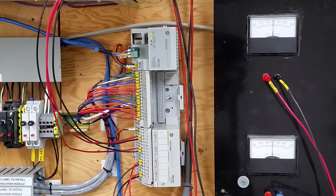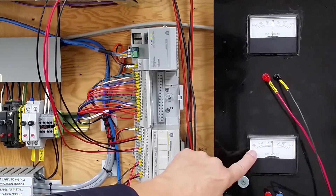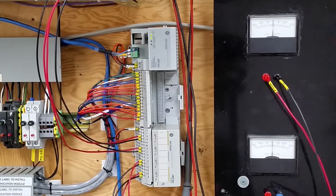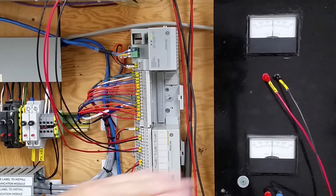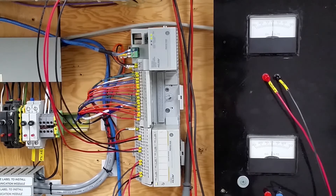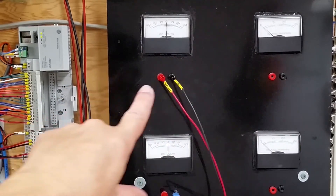We're back. The module is now wired up for voltage, tied to our Simpson 0 to ±30 volt DC meters. This is channel 3 and channel 2. We go: 0, plus 3 volts, plus 7 volts, plus 10 volts, negative 10 volts, negative 7 volts, negative 3 volts, 0. As you can see, this is the same module where channel 2 had a problem in current mode — but in voltage mode, it works fine.